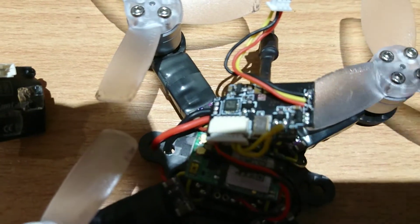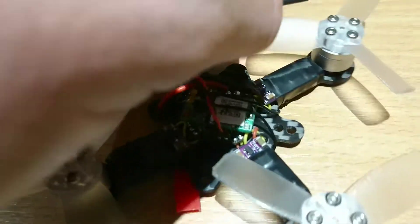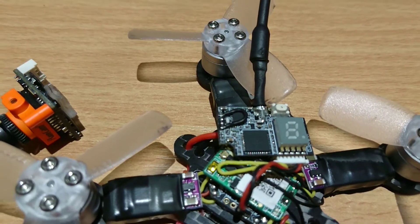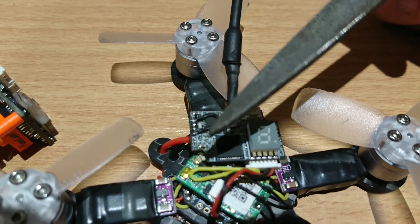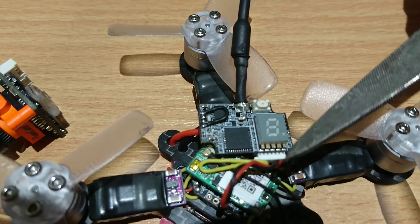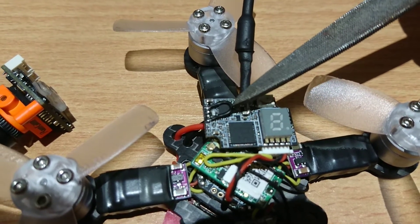It has its own separate pad, so what you have to do on the back side — if I turn it over — is literally run a loop of wire from the very bottom pin to the very top pin. That basically transfers the five volts into the VTX to make it come on as normal while still powering it on the bottom. You must add this or the VTX will not power on whatsoever.